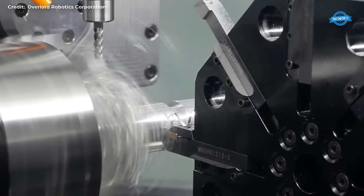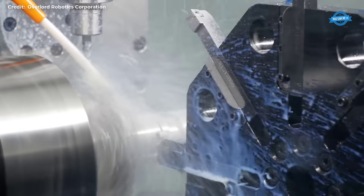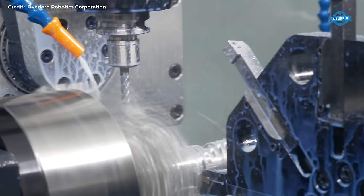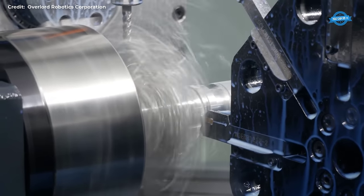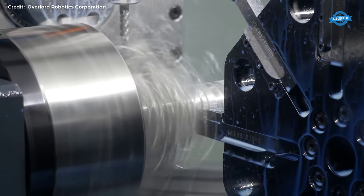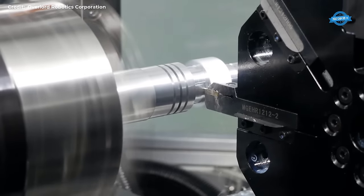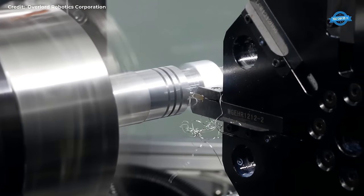Future upgrades and features for the Swiss Mach include rigid tapping and spindle indexing, live tool capability on the lathe turret, B-axis locking and alignment pins, hard anodized boxways for long-term wear resistance, compatibility with touchscreen controllers and automatic tool changers, and more, ensuring that the Swiss Mach remains a versatile and adaptable machine for years to come.